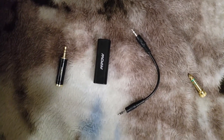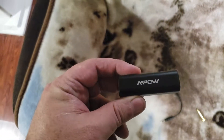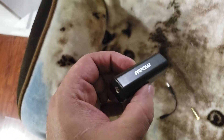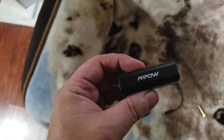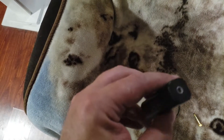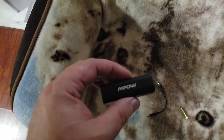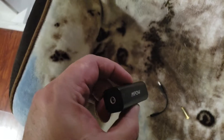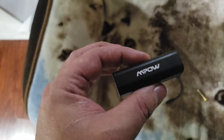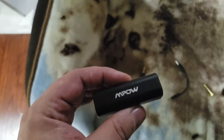This is a real quick solution — I got this on Amazon, it's called an Mpow ground loop isolator. All it really is is two transformers in series on each side of the connector, to remove any ground loop so you don't get that clicking and popping through the comm system. These are made for cars, but it works just as fine for a plane — the concept is the same.